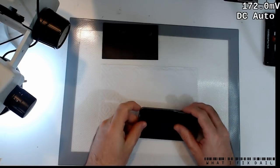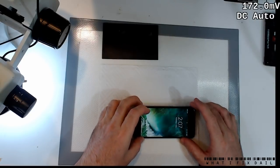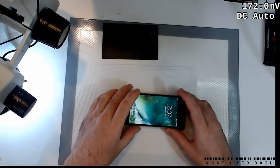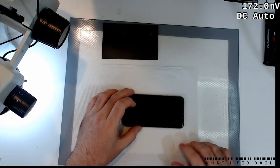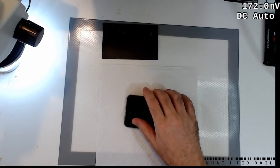Today we've got an iPhone 6 with a no service/SOS problem. I'm going to assume it's a baseband CPU with a U1/V1 type fault. It's not a guarantee, but we'll crack it open, have a look and see how we go.